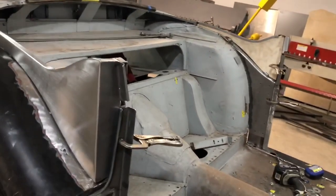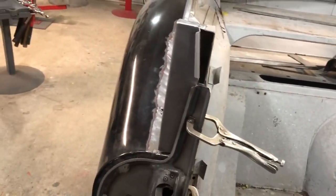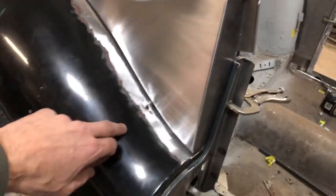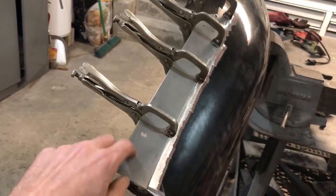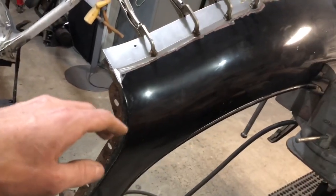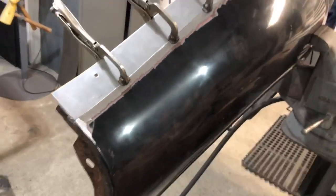It's moving along — it's a lot of metal repair and a lot of goofy angles. This fender I already did, but it's going to have to get sandblasted because there's more rot in here, or I can just grind it off. I figured I'd start on this fender because it won't stay held up in the wheel well. I'm going to get this done and planished, and I'll show another video of this finished with all the rust repair complete.